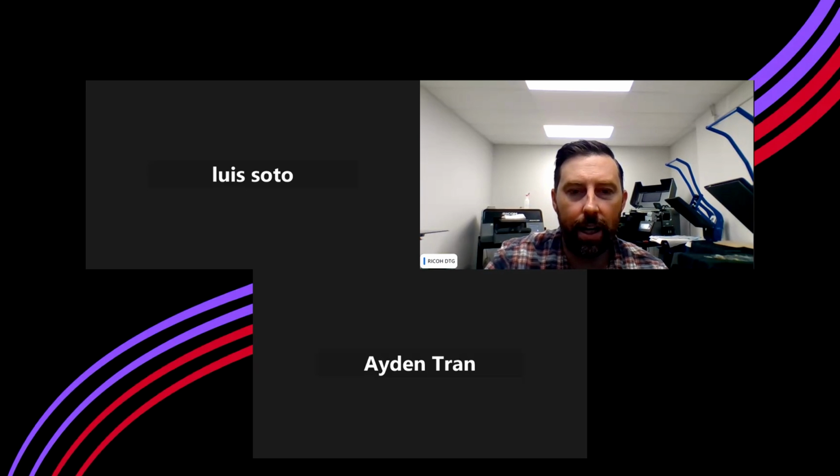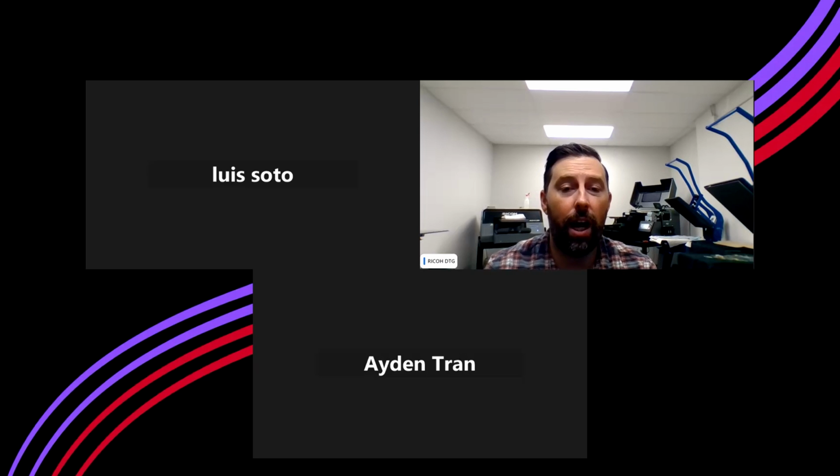So this person says, hi, I've heard about ink lines clogging and ruining the print heads and causing problems. How is this different in the 4000? So yeah, the clogging happens with not only all direct-to-garment printers, but any inkjet printer that has white ink in it. If there's a print head and there's white ink, they can clog. Even huge $500,000 flatbed printers with white ink can clog the heads. But it's totally avoidable.